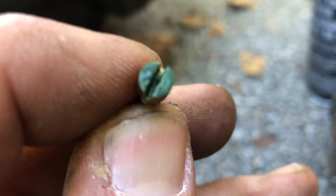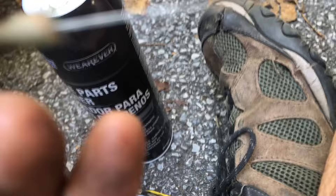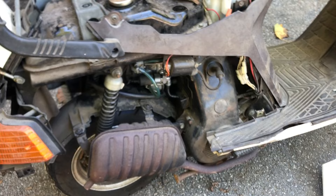There's fuel in the bowl with a little bit of crap in there. I'm going to take out the main jet and the pilot jet, clean that, and that usually does it. I'm using a 10-gauge banjo string to clear out the little holes. You can see the green gunk on the pilot jet — there's no visible hole there, so we'll clean that off, squirt the hole out in the carburetor. The fuel just keeps gunking that carburetor up if it sits too long.